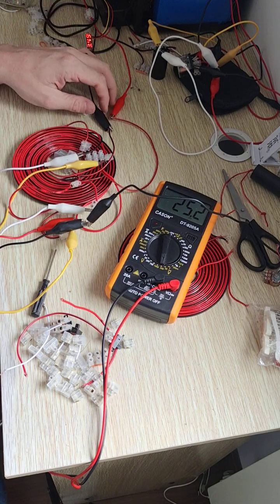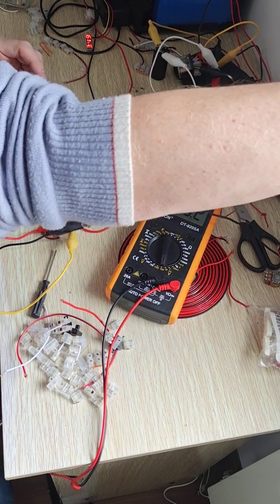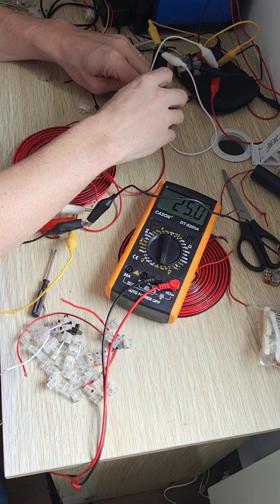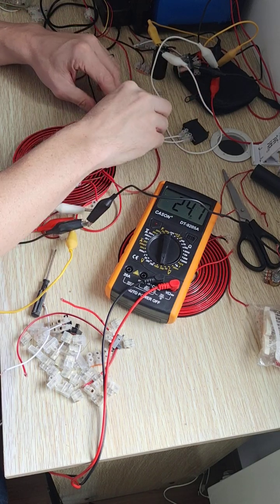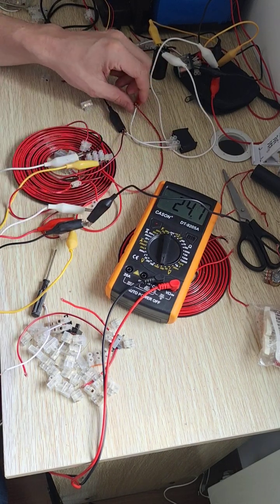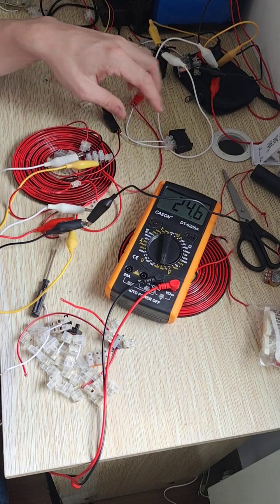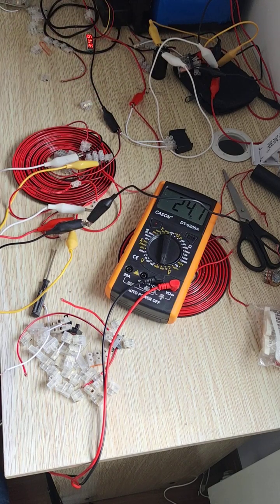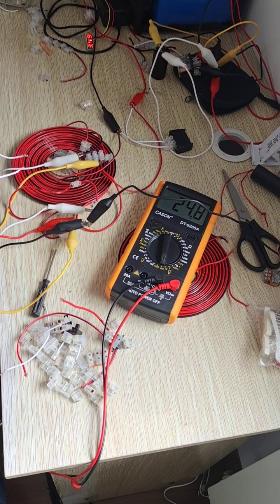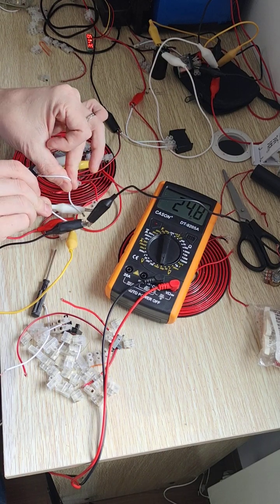So I figure no matter what, I'm going to have a capacitor across my input. Let's just see what happens if I put the capacitor across the input now. Not much difference, but you have to have that capacitor across the input to enable the input to resonate with the output. Also, what if I put the capacitor across the output of the coil?